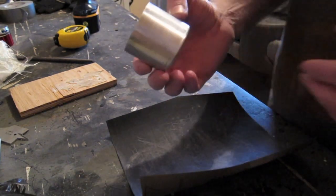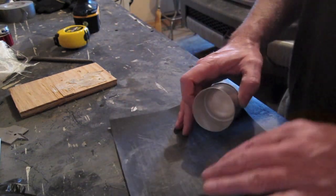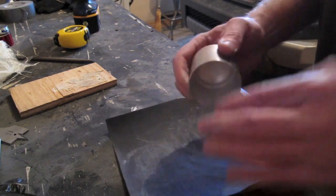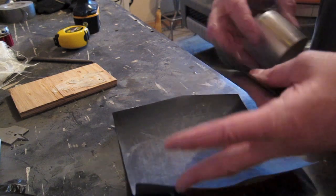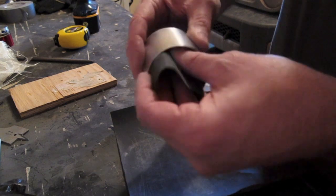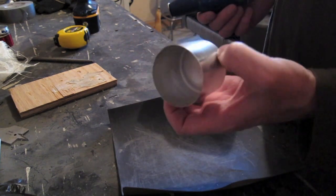Out here in the garage now — there's the can that I cut. It's a very clean edge, just a little bit of a burr around it. What I have is just an emery cloth and I just go around the edge like this and file that down, which does a good job. Then I'll take the burr off the top, and on the inside I'll just put a strip of emery inside. And you have a very nice edge on that. That's how I cut my bud bottles.